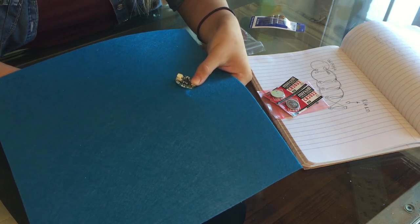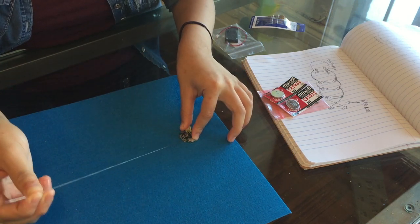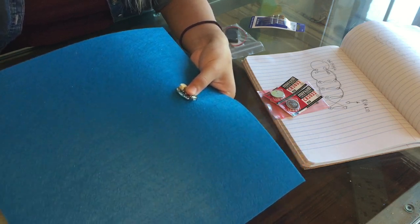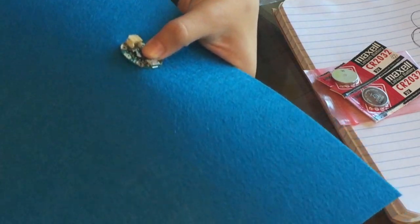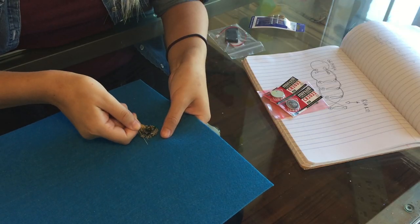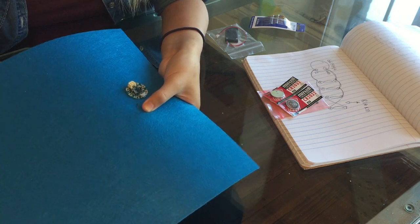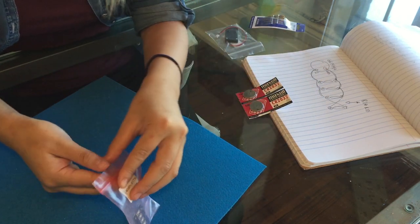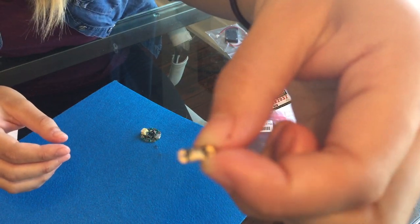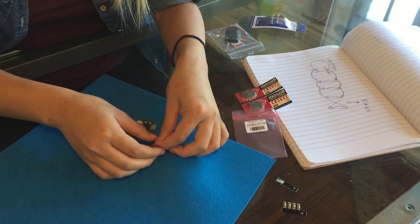I'm going to do the negatives of my LEDs first, sewing through the GND pin on my fabric directly. You want to create several loops around the metal-looking part on the pin because that's what connects the board and the thread together to form the electrical flow. I'm using a classic running stitch through the felt. From here I'm going to grab my LEDs — I chose green ones because green is my favorite color. There's a negative and a positive side to the LED, and it's clearly labeled, so we're going to stick the needle through the negative side.